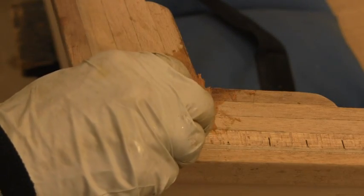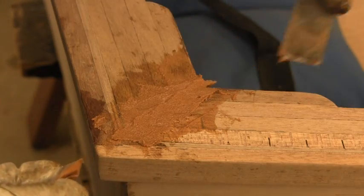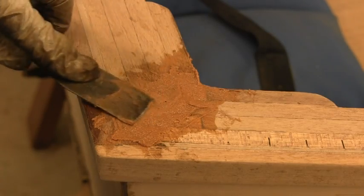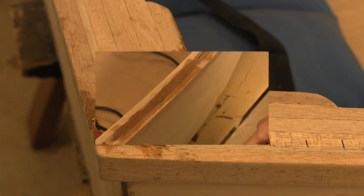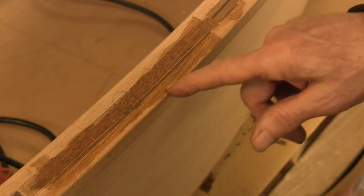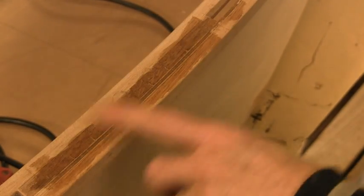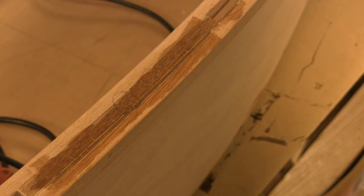And I'll leave a little bit high. Come back and sand that down. I'm gonna go do the rest of them. That's basically it. I even took my putty knife and some of the leftover and filled in the holes, the sight holes we made here. Now I'll have to sand that down again so that the stain will penetrate any epoxy that's on the surface. So I don't know how much time this is, whether we'll come back for the trimming or not.